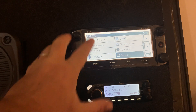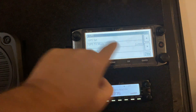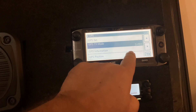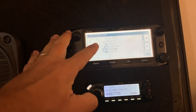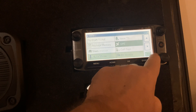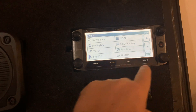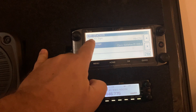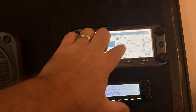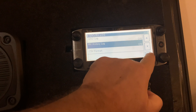In the menu system there's a lot of great stuff to go through. One thing is GPS — you can set it up to transmit your GPS location, which I'd recommend turning on. You can also view your GPS position, altitude, speed if traveling, and your latitude and longitude. Under call sign, you can see I have W3CTK set up, which will transmit on digital. Under My Station, I have my call sign and a message set up — it sends my name and radio model number. QSO logs are also nice — I recommend turning those on so you have a record of transmissions.